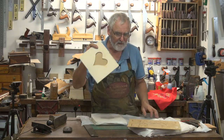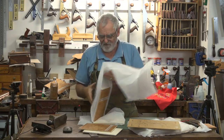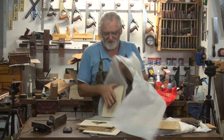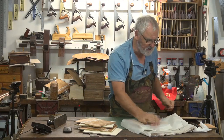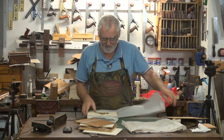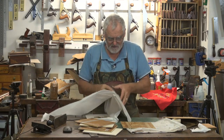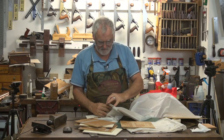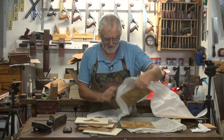Now, these I veneered up last night. And it's interesting to me how things evolve. Because when I started doing them, as you know, those of you that were watching, I was doing both veneers at once. But what I found was the challenge of that, getting them into the press, they had to be exactly on top of each other, or else you'd have uneven pressure.